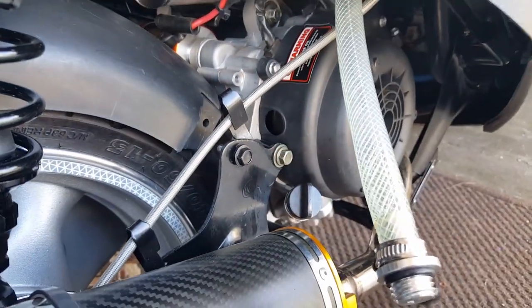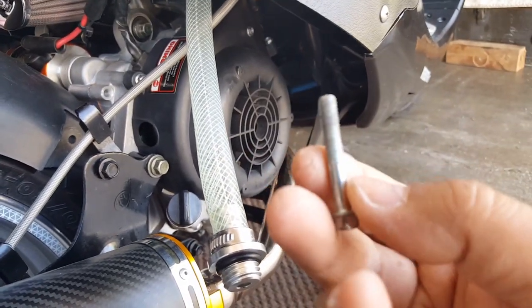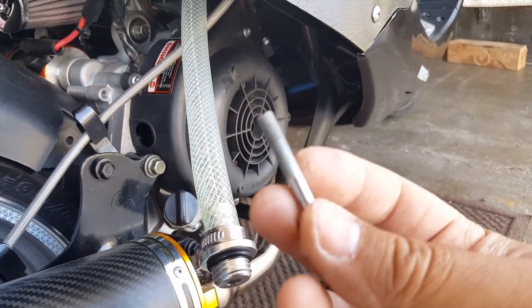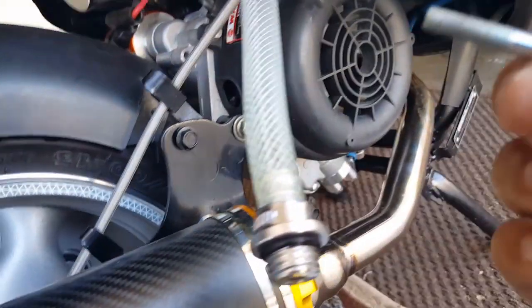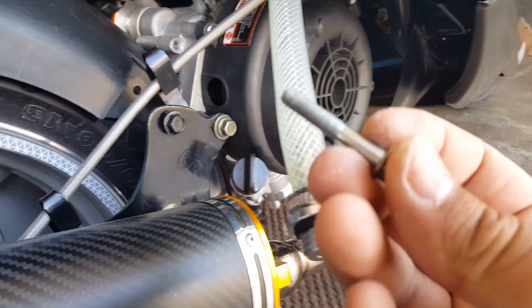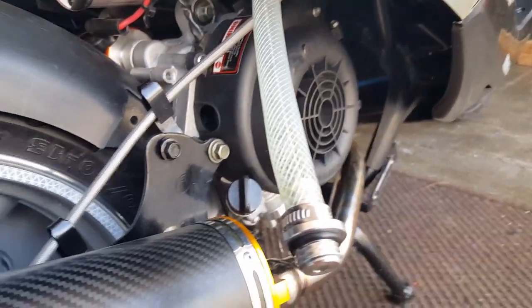All right, so we'll torque it back to 80 inch-pounds, which is equivalent to about 7 foot-pounds. So you can see here, he's not that. He's pretty much got this whole side here not threaded. Doesn't really matter to us, because once we put them in there, it should be replaced.